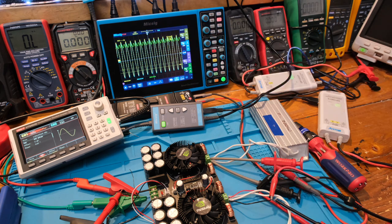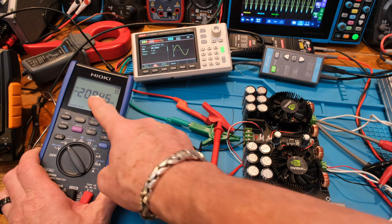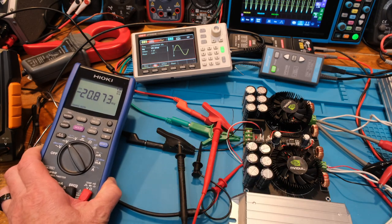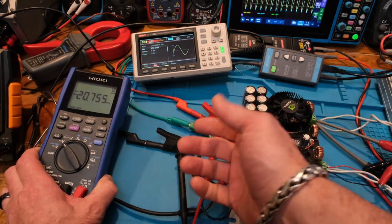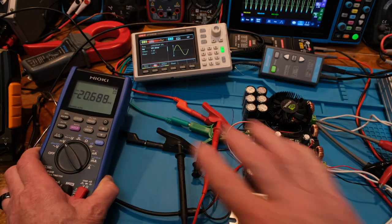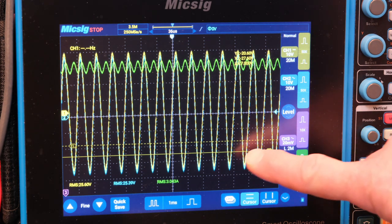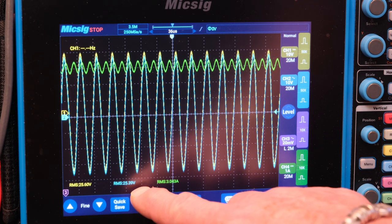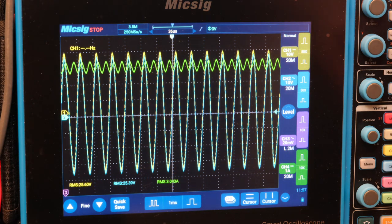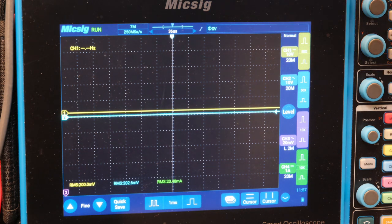I maxed out the signal on the generator and got as much power as I could on left and right with that power supply. The Hioki is reading about 20 millivolts left over on the supply — I'm measuring across the plus/minus voltage to verify I'm not losing too much across my leads. The power supply is at about 31.6 volts on both sides, and the Hioki reads 63.15 volts total. Our measurements are 25.6 V, 25.39 V, and 3.04 amps.